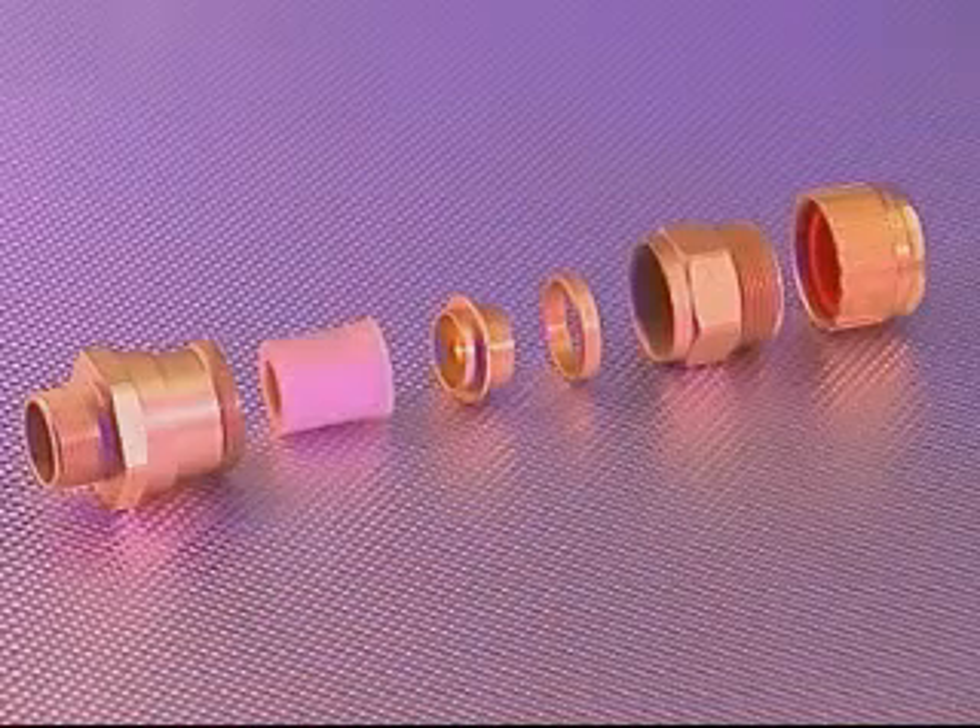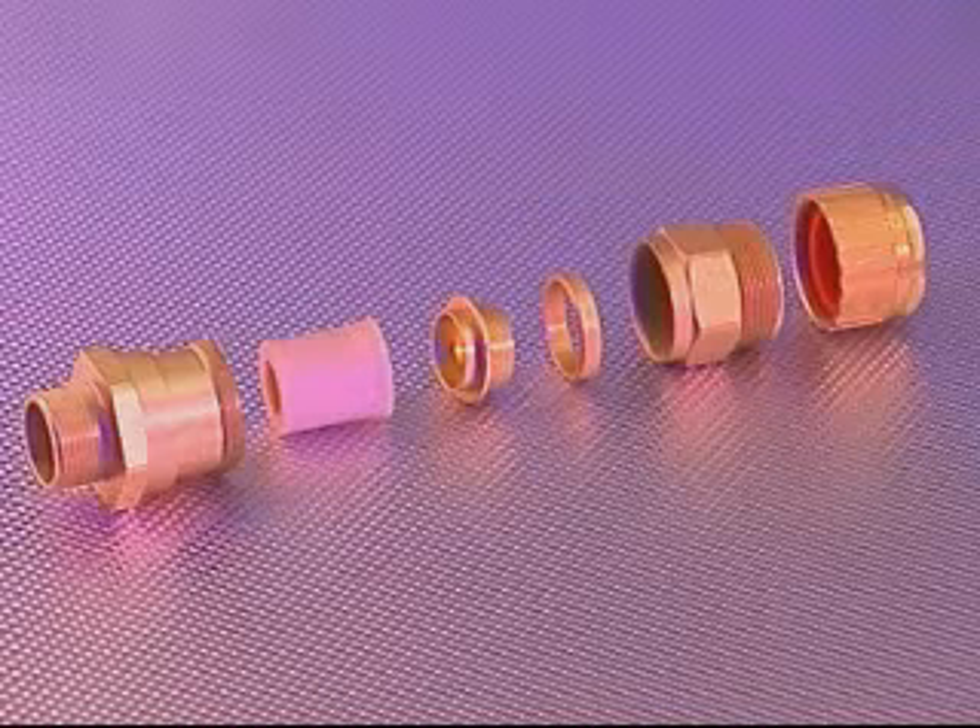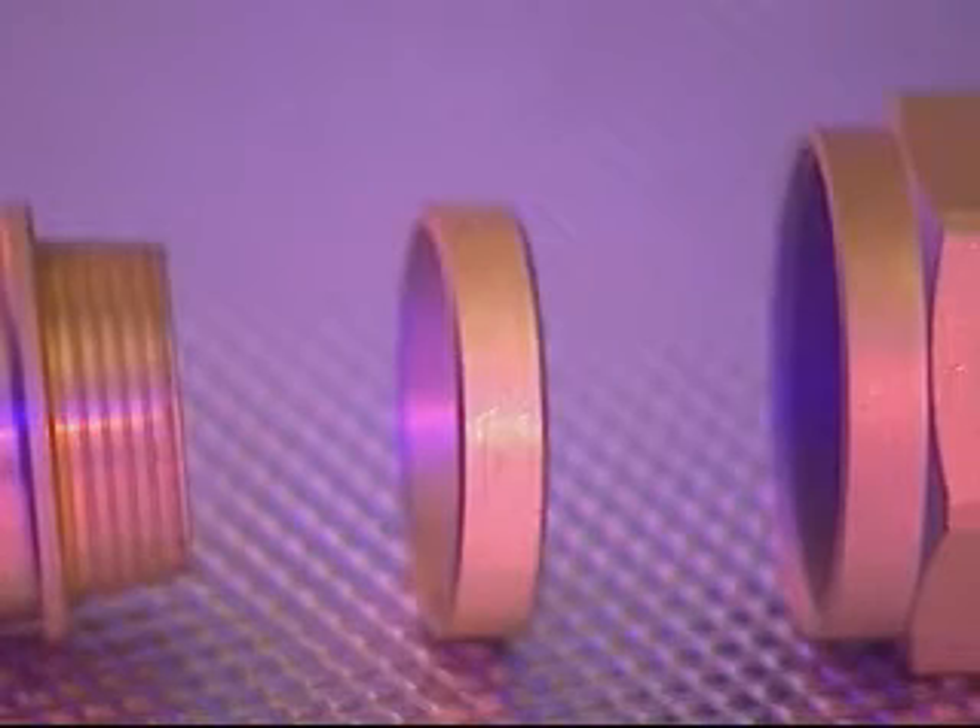The ICG-653 Dedicated armor cable gland comprises six major components, similar to the ICG-653 Universal cable gland, with the exception that instead of a reversible armor clamping ring, the cable gland is fitted with individual armor rings to suit each individual armor type or braid.